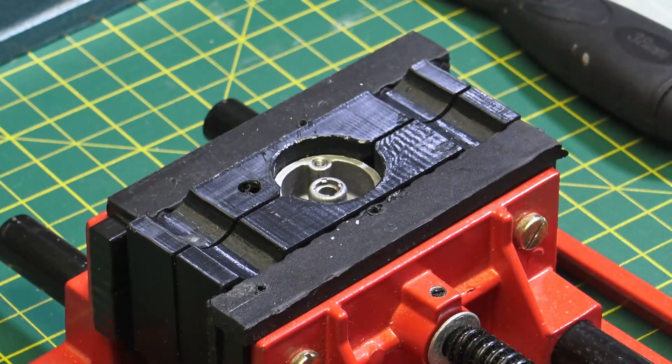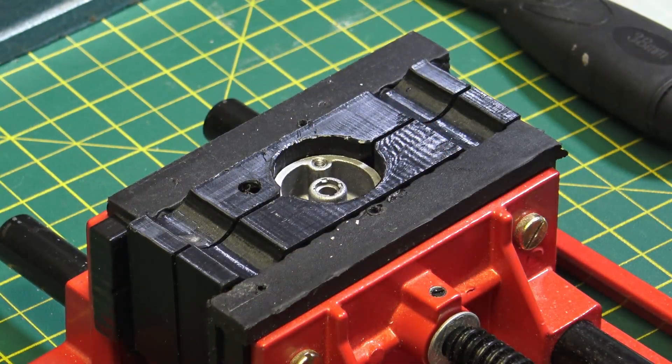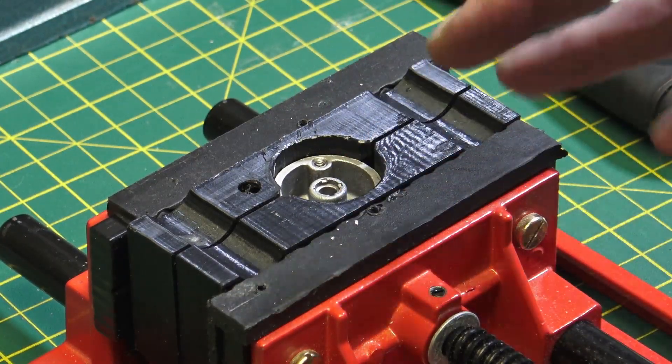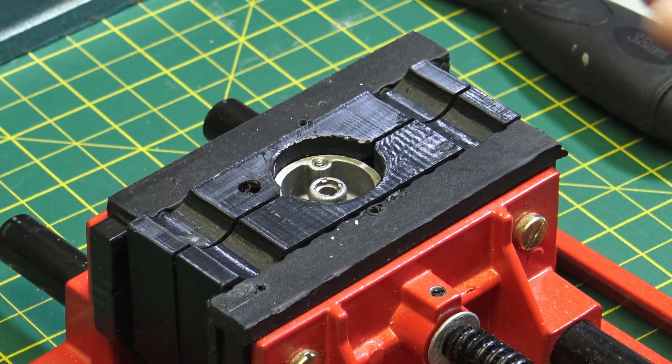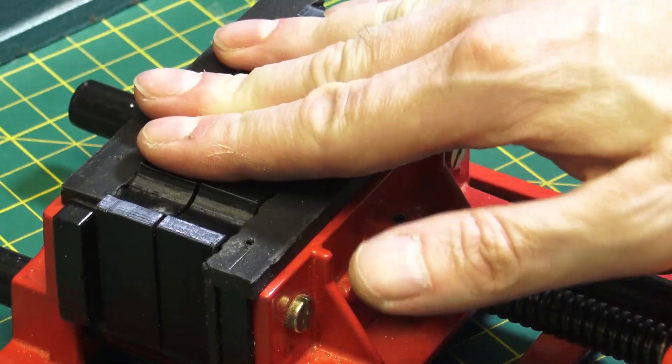So we have to use 5mm and a little bit of glue to hold it in place. We have to be very careful with the glue on the bearing — we don't want to glue the bearing so that it doesn't move freely. We really don't want to be using a hand drill for this; we want to use a pillar drill so that we can drill straight, so that the bearing is straight. And that was another reason why I made the bracket, so that we can keep everything straight and true.